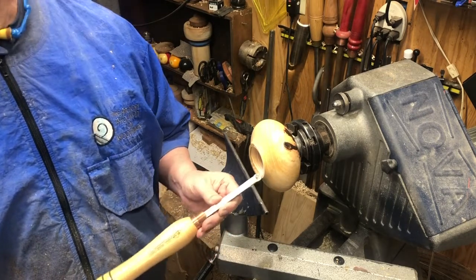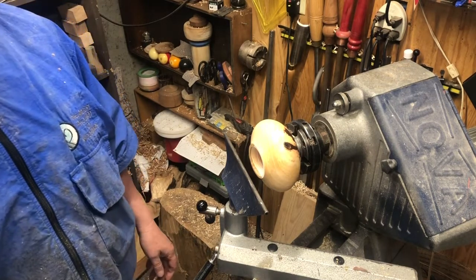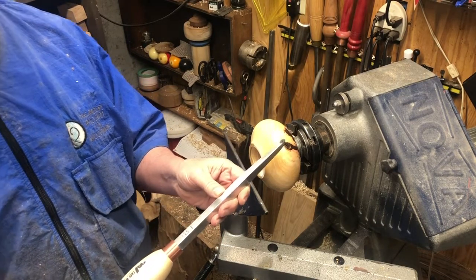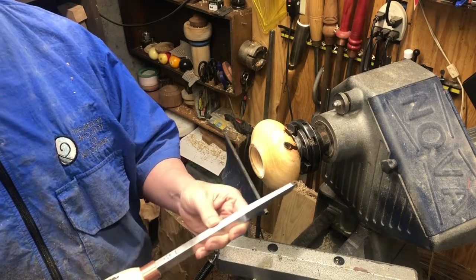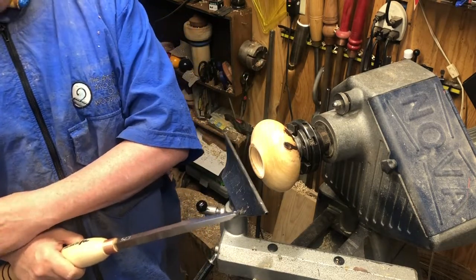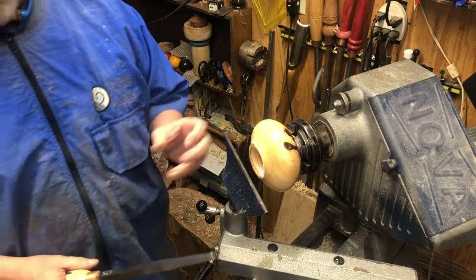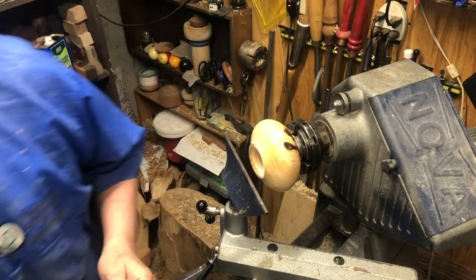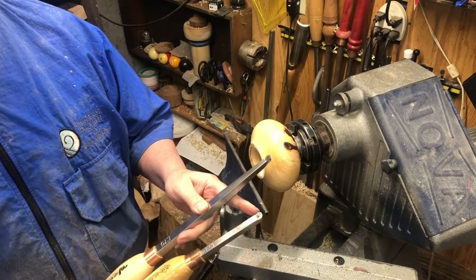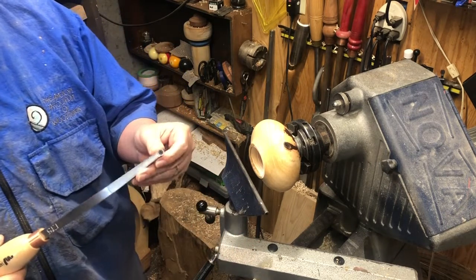These are excellent tools. These are carbide tip tools. You don't sharpen them or sharpen them very little, but basically you change the little cutters. This is one of the newer tools from Easy Wood Tools. It's the CI5. It's the hollower #1, or the #1 hollower. It has a little smaller head or cutter than what the CI0 has, which is the larger diameter. Even the mini has a larger carbide cutter than what this #1 hollower has. It's much smaller, but it will flat eat some wood.